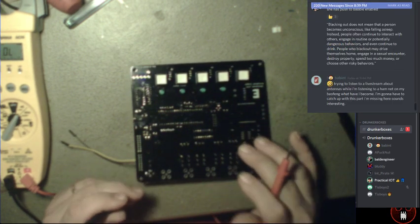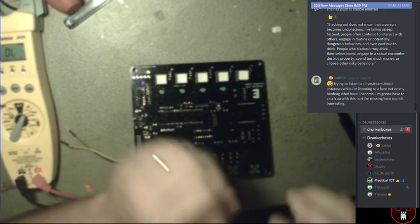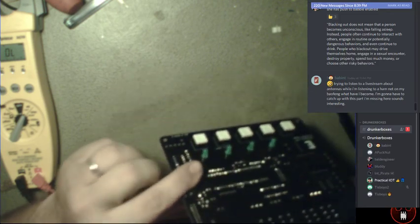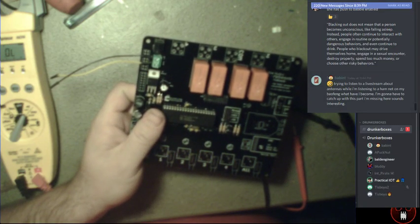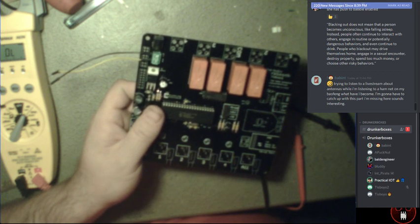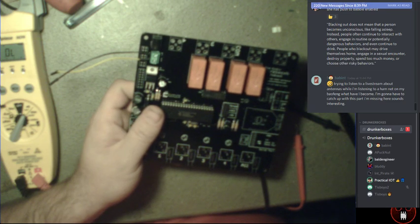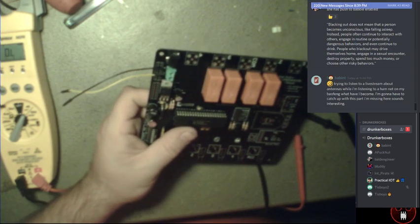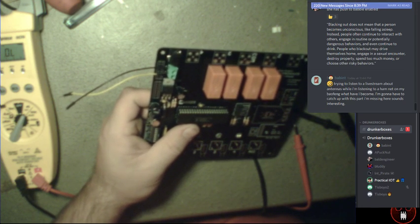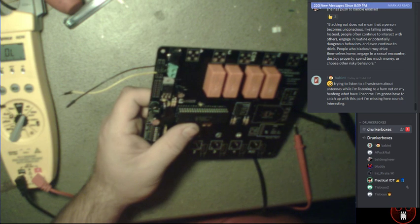And for some ham radio applications, we don't use coax. You might think of coaxial cable because it's shielded and heavily engineered and copper clad and so on, you might think that it's fairly low loss. Well, there are certain situations at the frequencies that this antenna switch is designed to operate at where rather than even using a coaxial transmission system, we'll use an old flat ladder line wire and have no shielding whatsoever, and it's just considered a balanced transmission line. So it's kind of counterintuitive. You think, holy crap, that's like 1940s tech, and it is, but it's extremely low loss.